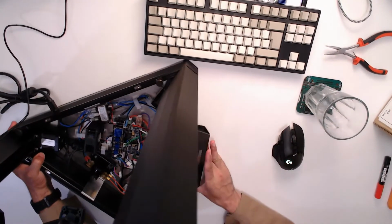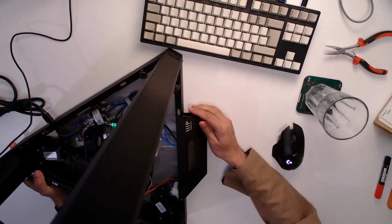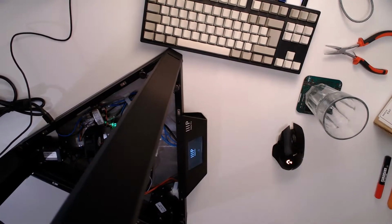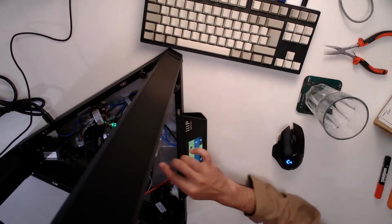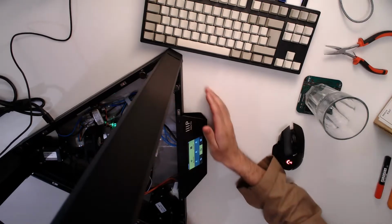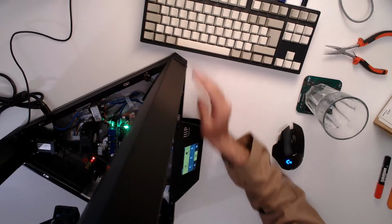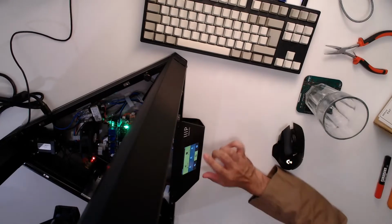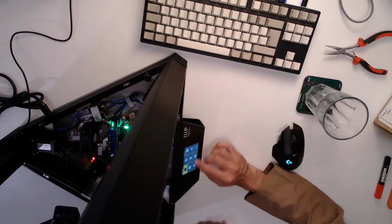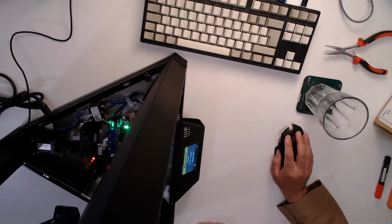So right now, you probably want to see the screen. I turn on the printer, the screen turns on. And now what I need to do, due to the micro stepping difference that I spoke about, can't see the drivers here actually. Can you see them? Yeah, okay. So these three have half the micro steps, and this one has a quarter. I need to go into the menu here and reconfigure that. Configure the micro steps. So if I go to settings, motor, I can zoom in here.